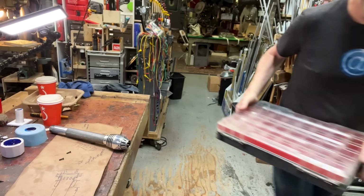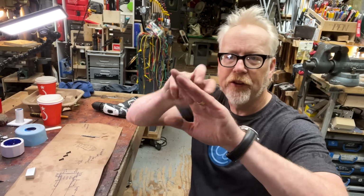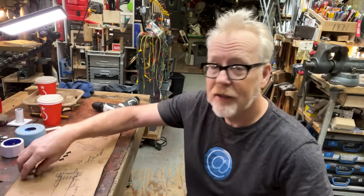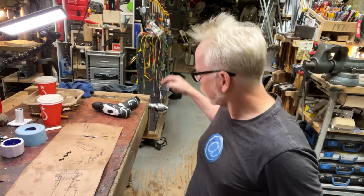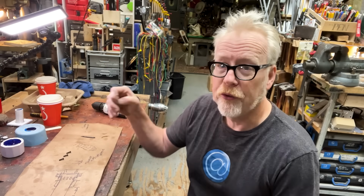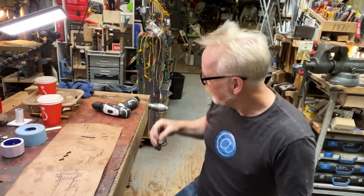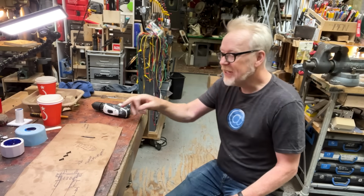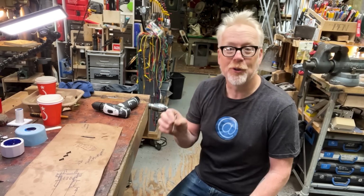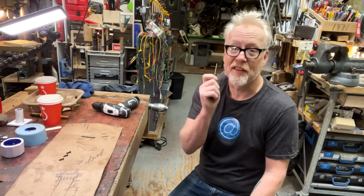Always get one extra screw. In an operation like this, where I am drilling through a surface to tap into another thing, i.e. the outer shell of this to tap into this, I start all the holes with the tap size. Later, I'll open these up to let the bolts slide through, but for alignment, you start with the tap drill only, not the through drill.